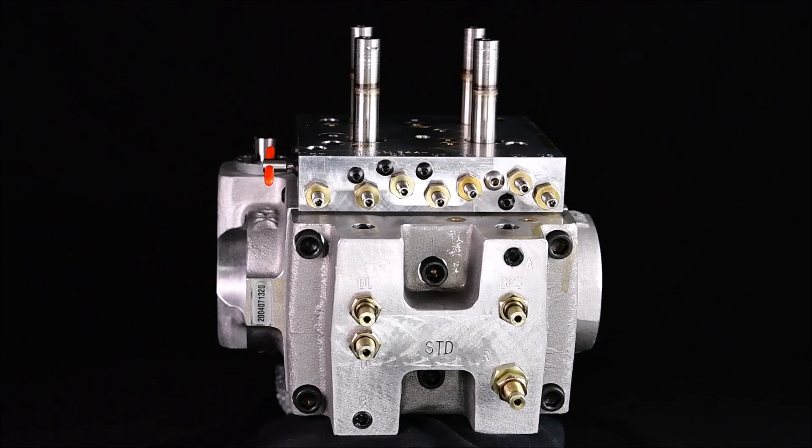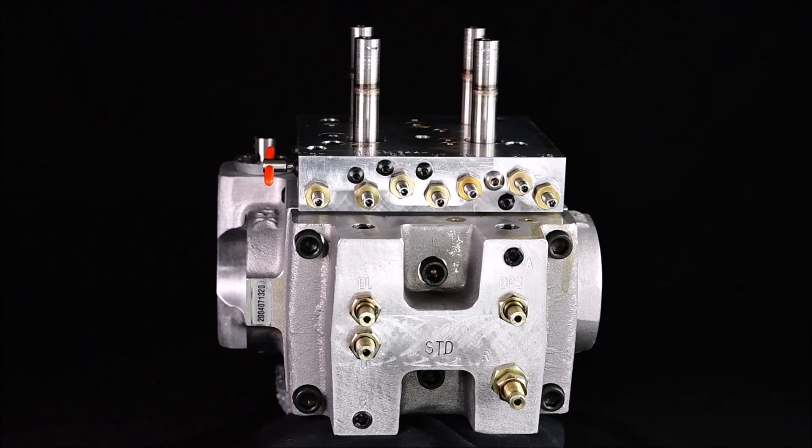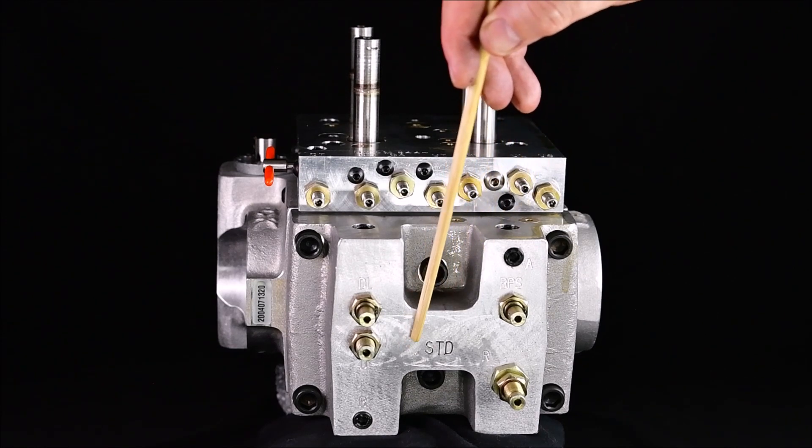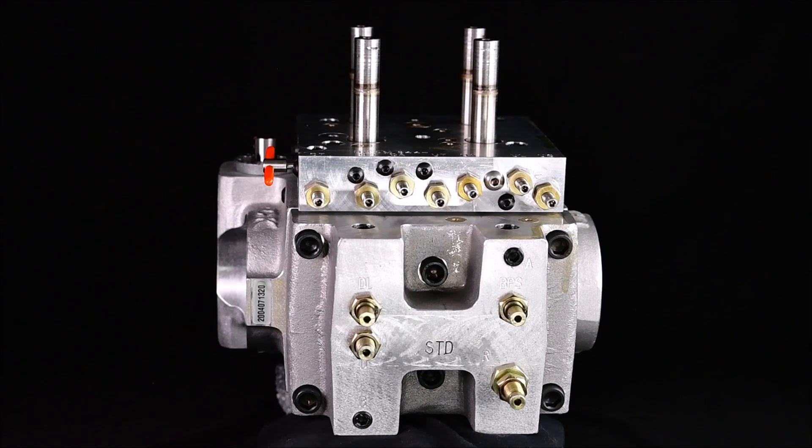E1 is the most restrictive, E2 is in the middle, and standard is the full flow version of this valve. On Otis installs you may find that in place of the letters here it may say 271 followed by some letters and numbers — those would be the new Otis part numbers for this valve. If you have a question, call Linden Elevator.